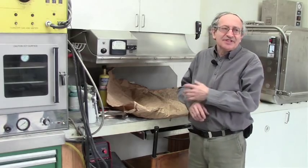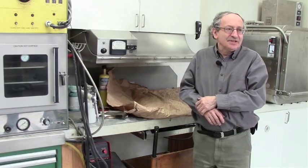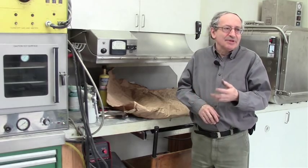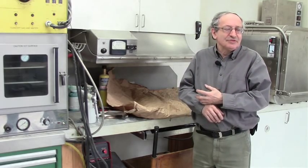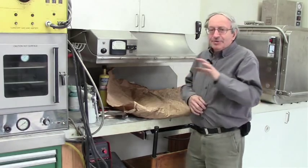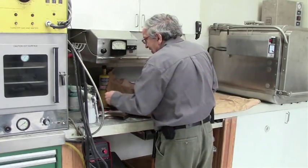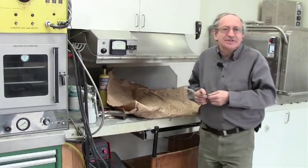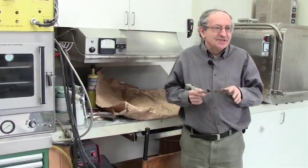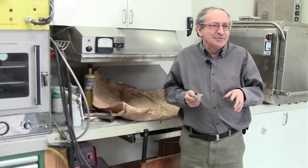Some of it through the surface energy, which is released off the surface. Some of it through chemical bonding, like for example, when you bond glass with silicon rubber adhesives and so on, in some adhesives you form a true bond and get a tenacious bond. So we'll talk separately about bonding, so let's just talk about painting. The classical way they talk about in books for preparing a surface for painting is completely useless, because all the books say clean it with a solvent or rub it with sandpaper.